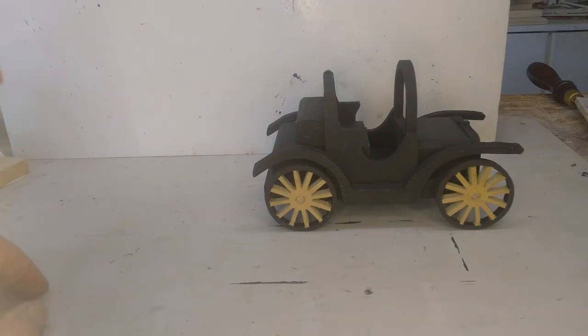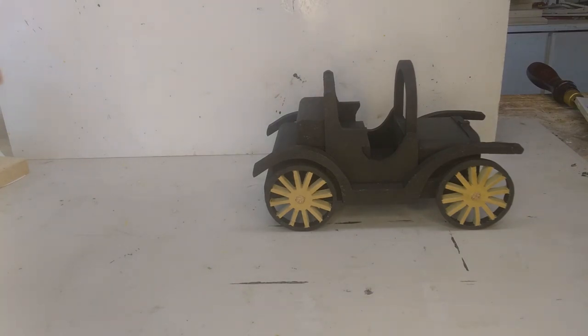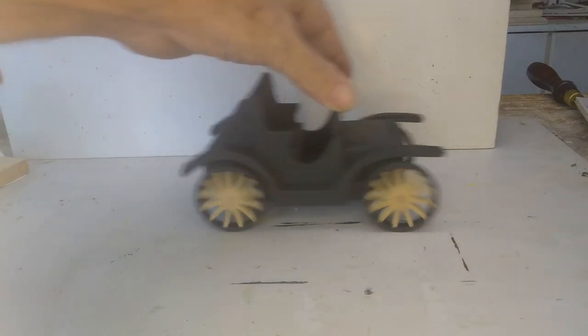if you have an axle pin, you can use that. But I wanted to try that technique that I saw to drill that 3-inch deep hole straight out the other side in a 1/2-inch piece of material. And it worked. It worked just really, really well. I was very pleased with it. The thing is, if it didn't work, that's just poplar. I could have gone and got another 1/2-inch piece of scrap around here, and gone back and drilled those holes for the individual axles. This way, they line up pretty well, and everything is in its proper place.